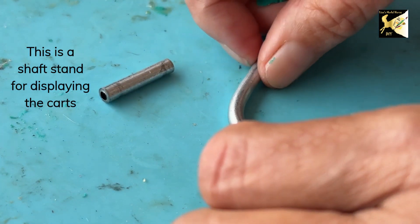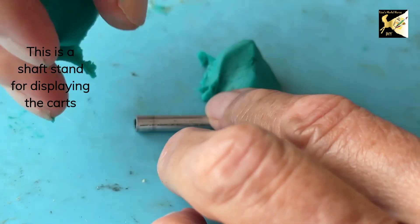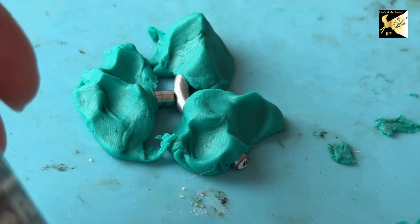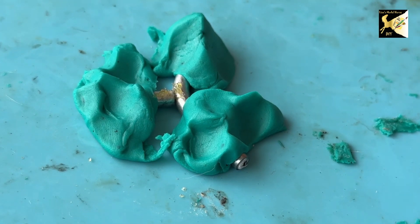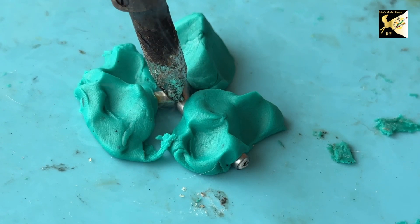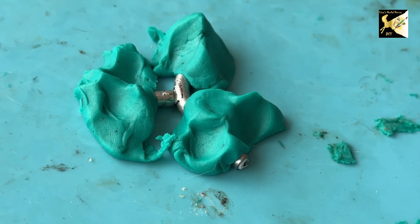In my other videos you can see me work, but let's just see some really simple examples. When I work, I like to hold stuff in place. So in this example, I'm putting Play-Doh on top to hold things. When you're working, you must flux everything — every time you work, put a little bit of flux on the join, and if you have to do it again, add more flux. Now the key thing to know is that solder will travel into the area of heat, so I am sticking my iron right at the join to heat things up. Then I apply the solder — and the solder that was already on the tip has already soldered it. It was that easy.